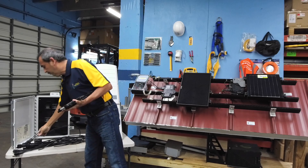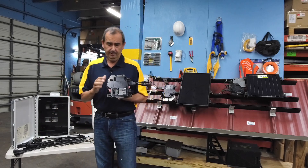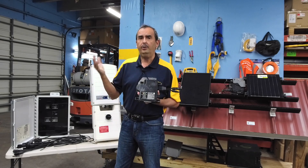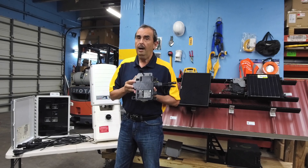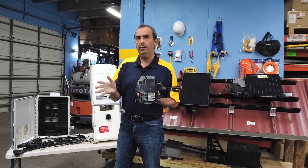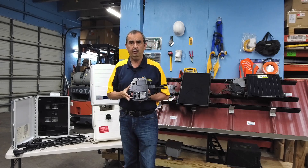One of the main benefits of a microinverter is that you're going to enjoy the same warranty on the microinverter as you do on your panels. Microinverters come with a 25-year warranty, both labor and parts. That means that for 25 years, nothing can go wrong with your system — versus the warranty on a centralized inverter, which is usually much less.